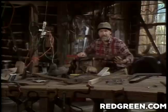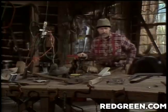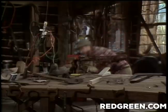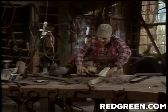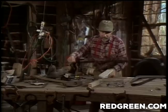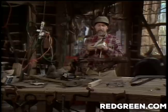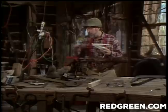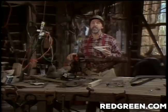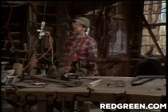I need the chuck key. I go through chuck keys like pencils and hammers — unbelievable. I buy them by the gross; this one will last me about three months. Now for our speed control, I got this thing off my wife's sewing machine — never been used. This will turn our drill into not only a lathe, but a variable speed lathe. So we plug the drill into the pedal and plug the pedal in.